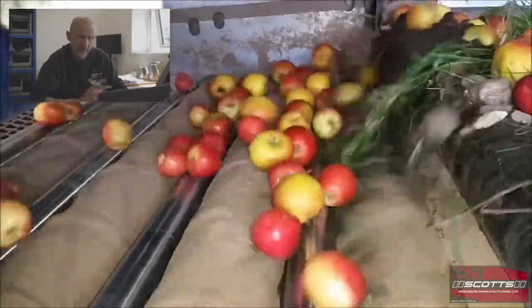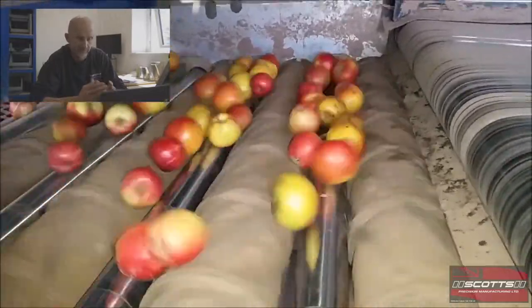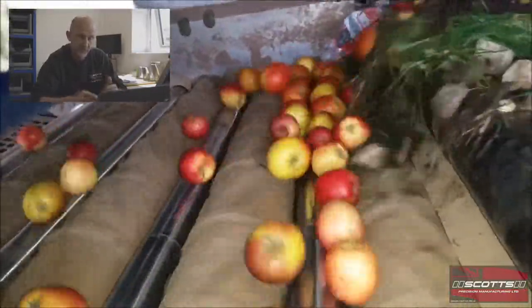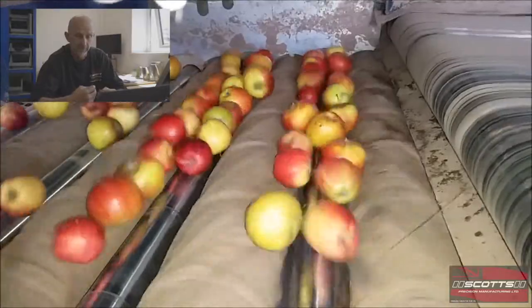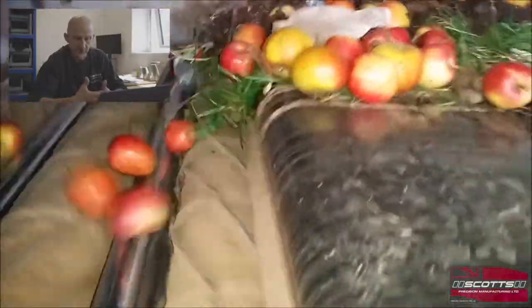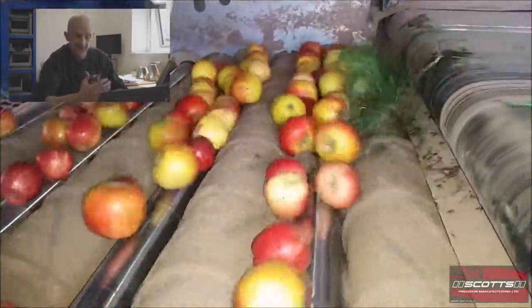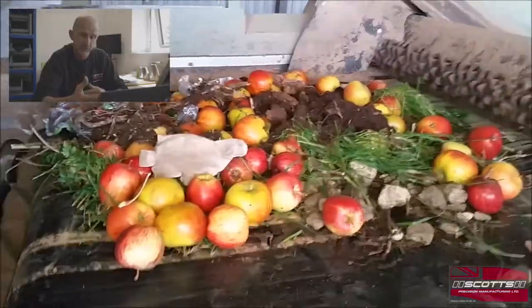What's really easy for us with apples is the fact that apples are generally very hard, very round — no square edges on apples. So where we're trying to extract anything that is misshapen or soft or leaf-like, we're always very mindful that we're not too aggressive and we can damage the skins of the product. Well, apples are generally getting processed and, as I say, being hard and smooth, it's very easy to set the machine up quite aggressively without any fear of losing the crop.